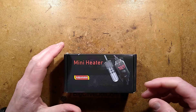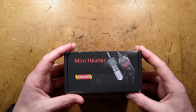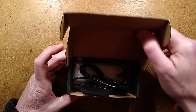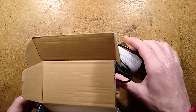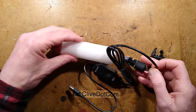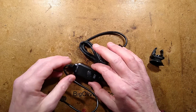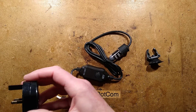Here is an oddity. It's an aquarium heater, could have other applications, but it's designed to run from a USB power supply, which is quite strange because it's just 5 volts. The listing was a bit deceptive about the power rating — one of them said it was 25 watts, which would be 5 amps on a USB power supply. So probably not accurate, but in reality this thing is rated theoretically 10 watts.